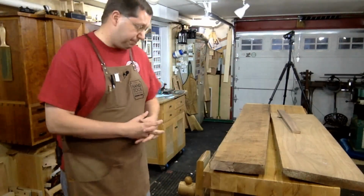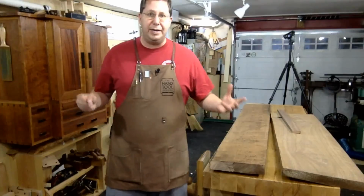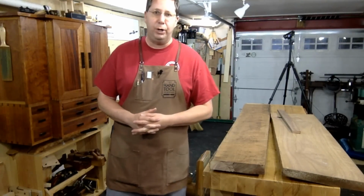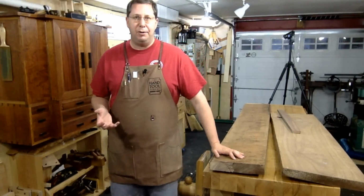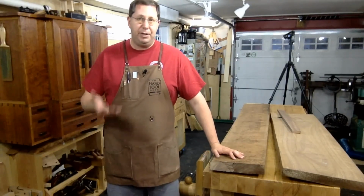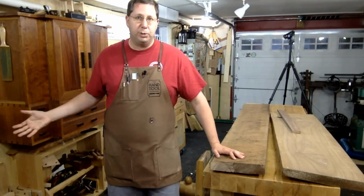In my experience, you can find auger bits by the scores on eBay, garage sales. Go to grandpa'slittlefarm.com and Ernie will hook you up with auger bits. They are everywhere. There's no reason to buy a poor geometry modern bit when you need just a little bit of rust removal and an auger bit file. Pick up your auger bit file from Tools for Working Wood. You can sharpen them up super, super quick.